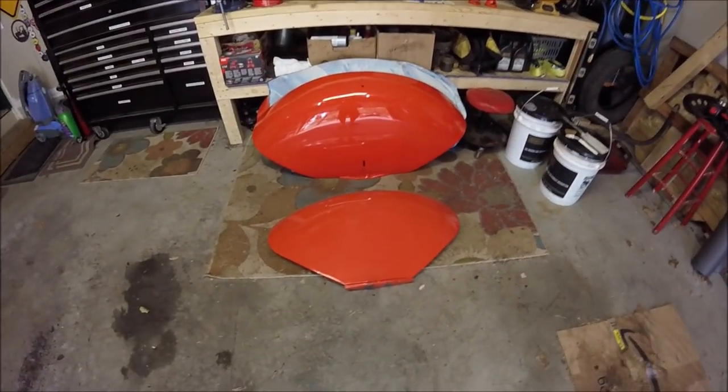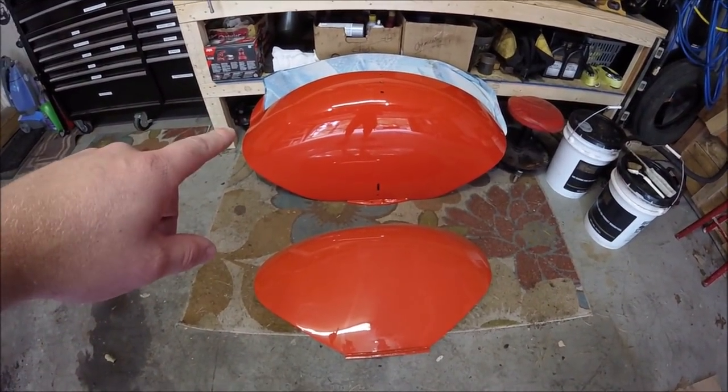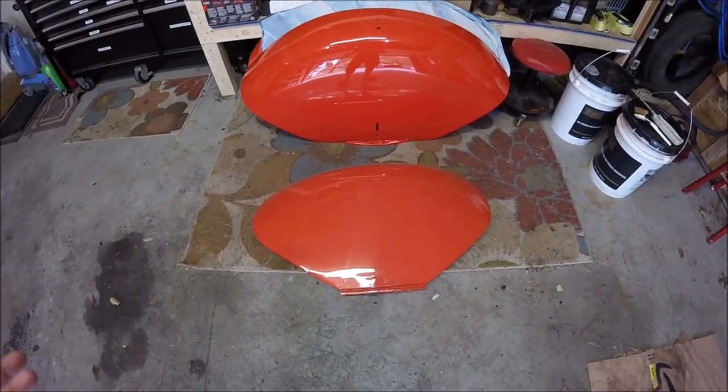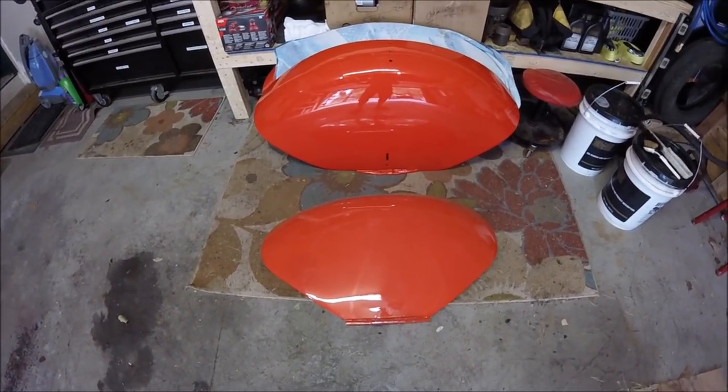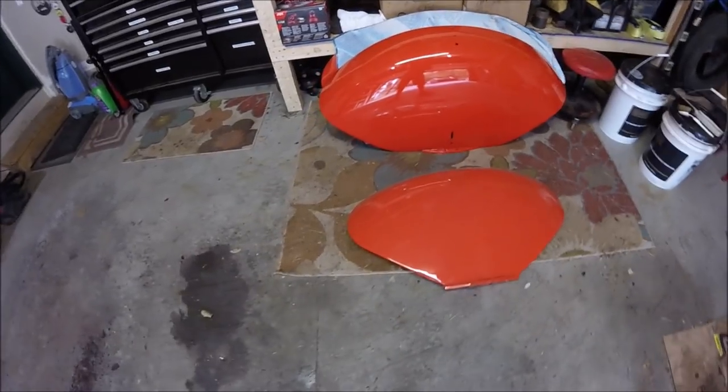I wanted to show you guys the difference in size between the 41 SC fenders and the mid-model SC fenders. And there's actually a third late model fender that has exposed ribs on the inside of the fender, or the operator side. But without further ado, here are the fenders laid next to each other. So the video probably doesn't do it justice, but you can tell this is the early 41 SC fender, and this is the late or the mid model fender that goes on like a 42 to probably a 49 or 50. I think they changed to the late model fenders when they came out with the Eagle Hitch,